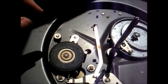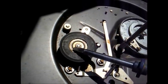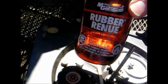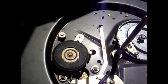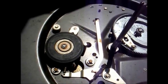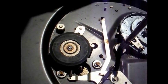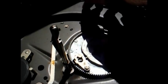Here's the inside of the mechanism. Here's the drive wheel — it's still soft but the surface is very slick, and I believe that's the reason it's not driving the turntable correctly. For that we use a product called Rubber Renew. I've used this many times and it'll renew the grip back to some old idler wheels if they're not too far gone. If they're too far gone you'll have to send them to one of the many services that rebuild these wheels, because they're not available as new manufactured parts anymore. It costs around $30 to have one of these wheels rebuilt.